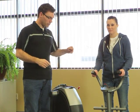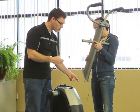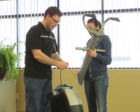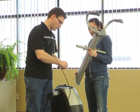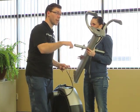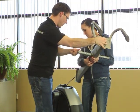Next, we're going to put the upright onto the base frame. This is the upright — it's this long metal tube. First, we need to feed this wire coming from the base frame up through the upright; that'll connect to the console and provide power and communication from the lower part of the machine. There's a black string tied to the top of the handlebars that comes down through the upright. Use that string to securely tie the wire harness so we can pull the harness up through the upright, making sure it's secure so it doesn't come off as you pull it through.